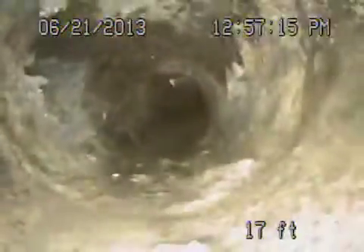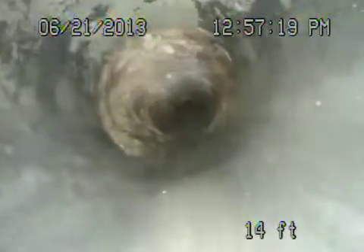We should be entering an ABS plastic pipe pretty soon. Now we're transitioning to the replaced pipe — this is all ABS, and it's all good coming back. All in good condition, all ABS plastic. We've got about 30 to 35 feet of cast iron from the ABS to the clay pipe. So here we are on the side of the house, running for this clean-out.